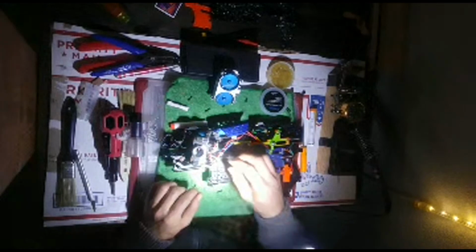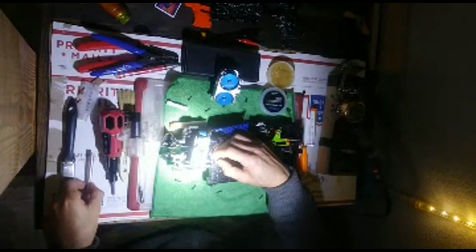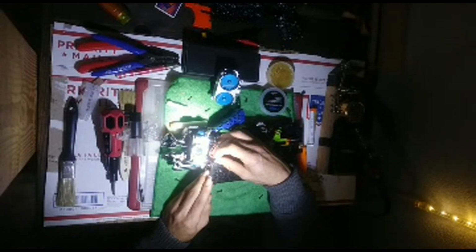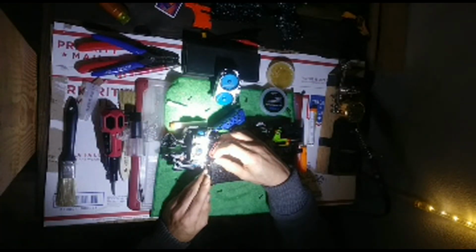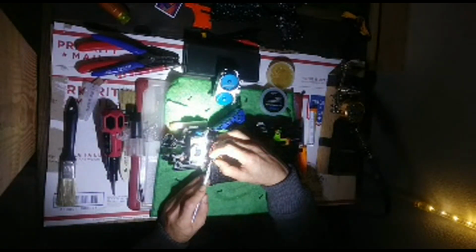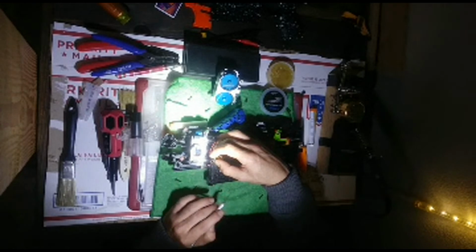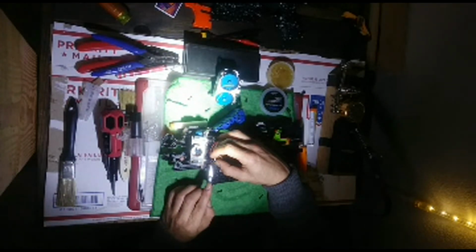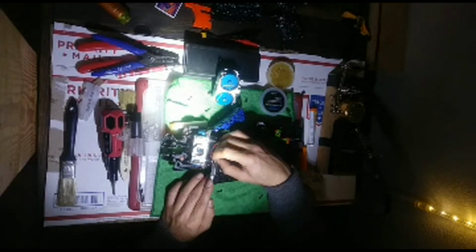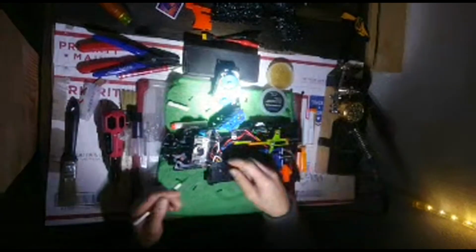So, this is what happened. The motor is still good. However, defect, the post broke off. So it wasn't the motor burning out, which, like I said, sometimes they do from just hitting the rev trigger too often. But the post, probably just due to the torque and vibration, sheared itself off. So this motor and this cage is gonna have to come out anyways.